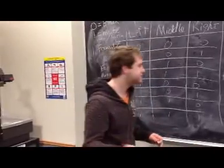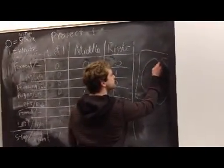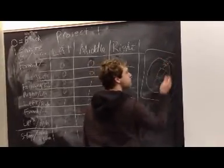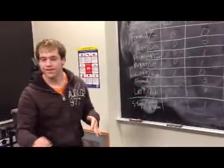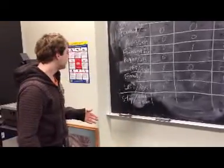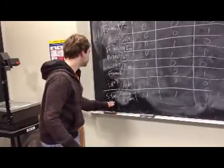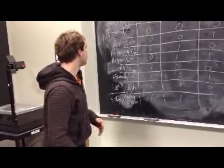Let's go back to our case diagram here. Here's our robot. You can see that it senses the tape right here. If it kept going past this point, it would actually plummet off the table, unless, of course, we had that white line around to make it rethink its actions. So if we do sense all 3 sensors with the 1, or the white tape, we'll stop. This is to prevent our robot from falling off the table.